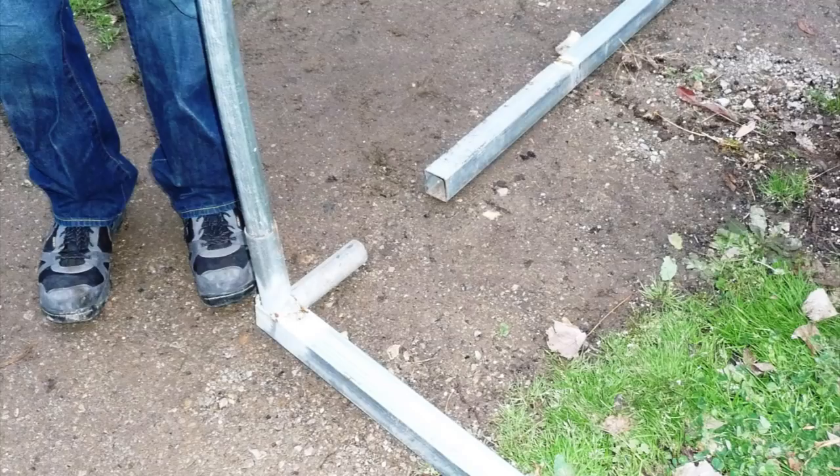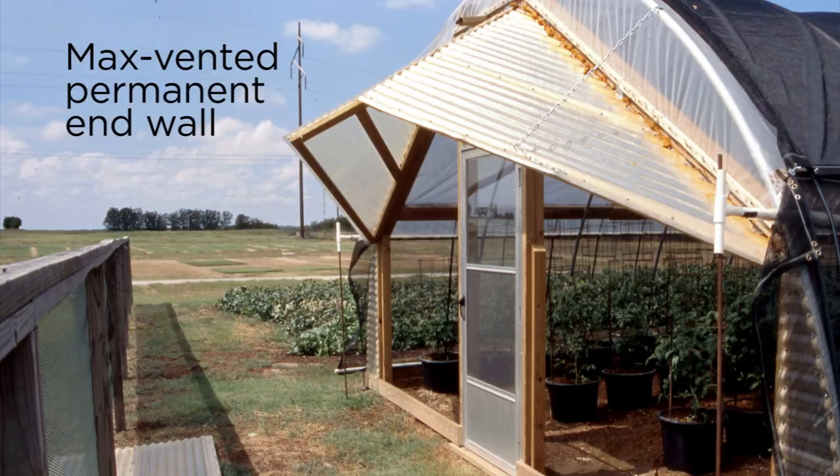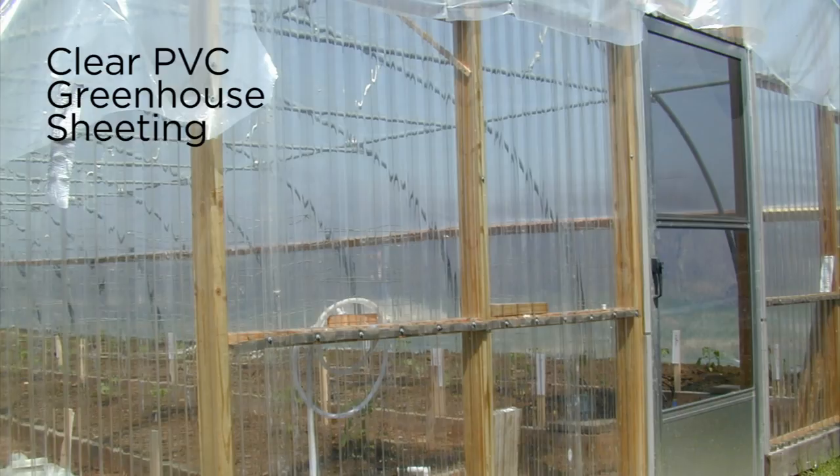When you custom design, think about getting as much ventilation as possible. For a permanent house with a permanent end wall, it can be open enough to get a small utility vehicle in there. For end wall sheeting, PVC or polycarbonate is expensive but low maintenance — and it's nice because end walls take a lot of abuse. For removable end walls and doors, I like ripstop plastic.